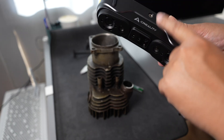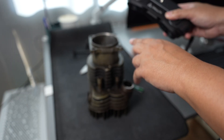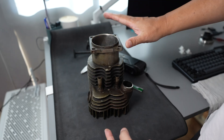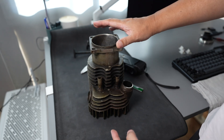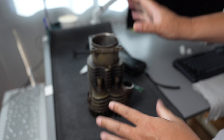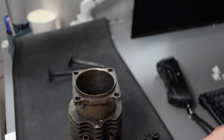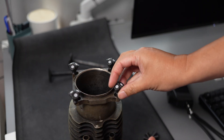The seven-line mode is the most accurate scanning mode with this scanner because the camera is placed closer to the object. I couldn't use seven lines to scan the whole jacket because I can't put markers on the object — it has a lot of detail. So I'm going to scan just the top part of the bore using a seven-line laser, going about two or three centimeters deep, and I'll place markers along the edge of the hole so they are closer to the scanning face. Closer markers give the highest precision. A stitching line appears when your marker is too far away from the scanning face — that's a precision alert.